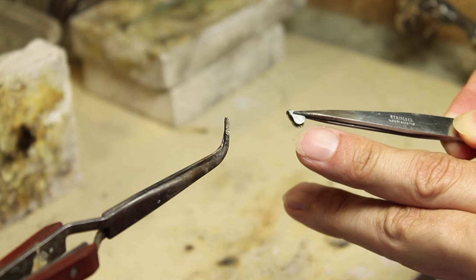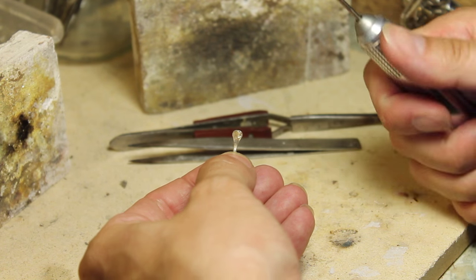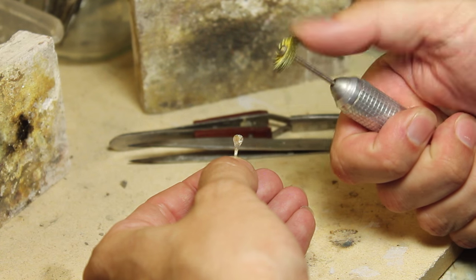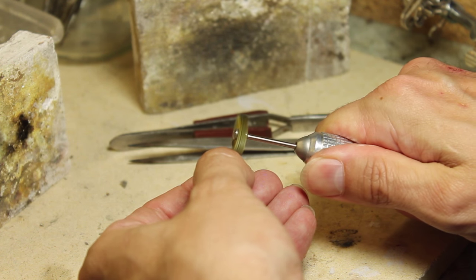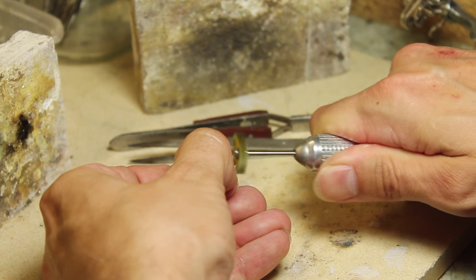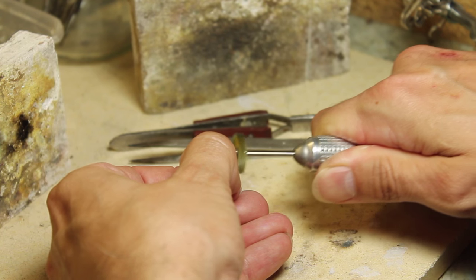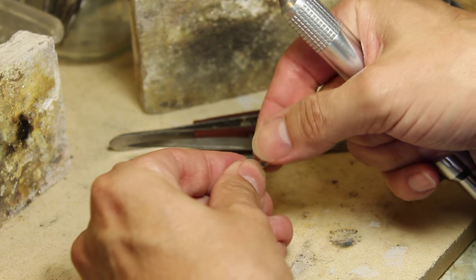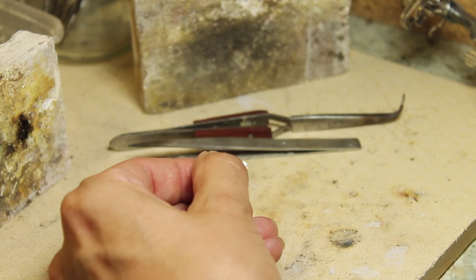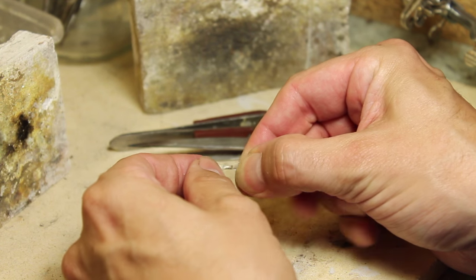This is the chain end here. I'm going to need to flatten this out and clean this chain end up, get it ready for resoldering. I could use a needle file but I'm lazy, so I've got my flexi shaft with a yellow 3M Scotch-Brite radial disc in there, and I'm just going to clean that up - get rid of any oxide or dirt. Remember when you're soldering it's always got to be clean and grease-free. There's still quite a little bit of solder on that but I'm going to apply some more in a moment anyway.